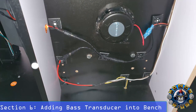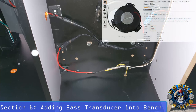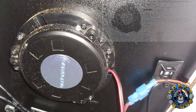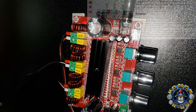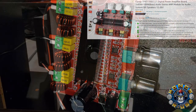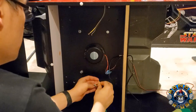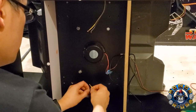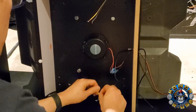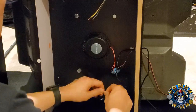Next up, I did the Retro Ralph mod of adding a mini bass shaker into the bottom of the bench seat. This is a Dayton Audio TT258 puck tactile transducer with 8 ohms. I also got a 2.1 amp to power the transducer and plug the stock Out Run speakers into. I centered the puck underneath the Cruisin' seat and wired the speaker cable through the front and into the cab. Even though everything is tied down, you can still see the wires in the final cab, but I may try to clean it up later.